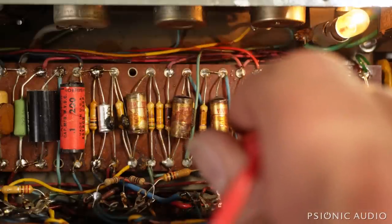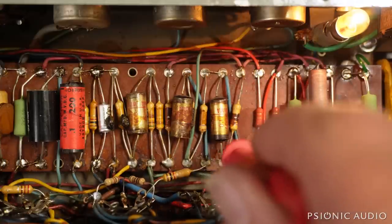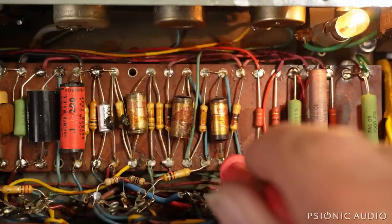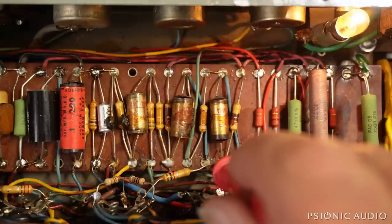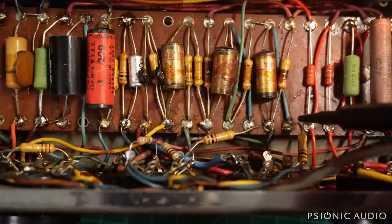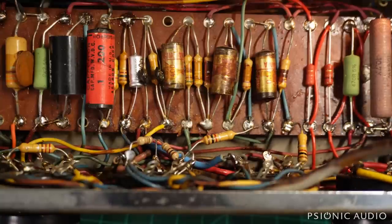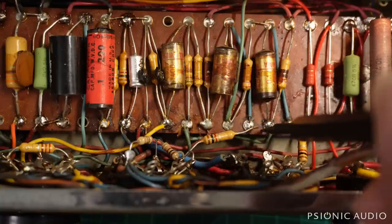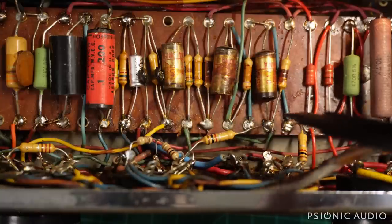It's actually going down now — nope. There is 1.6 volts right there in that glue. This is the B+ connection here, this is where the plate comes in, and this is the grid. And between where we've got 281.9 volts and where we've got about 70 millivolts, right in the middle — 1.6 volts. After scraping away the glue off the board in these areas, then soaking the board with isopropyl and really getting it down into the phenolic, cleaning off the surfaces, hitting it with a heat gun, and then reflowing the solder on these joints to drive some heat into this area — without changing any of the components in the amp, I've now got zero volts present at the grids.